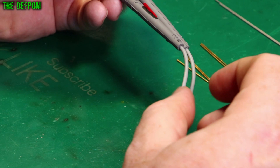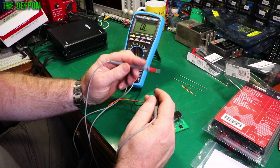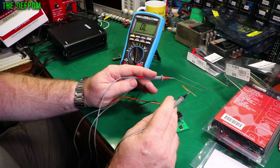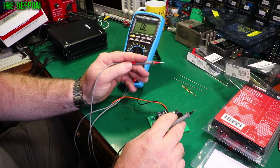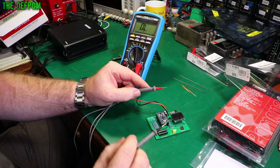The standard silicone cables on multimeter leads would be a bit bulky for this — these are meant for delicate work. As I've mentioned in my multimeter review videos, the quality of the probe has a big effect on your continuity testing. If you've got decent quality probes, continuity response is much faster. A cheaper probe with less nice coating will be a little bit slower and take more pressure to get through oxidized coating.